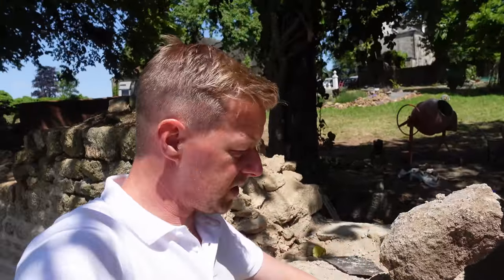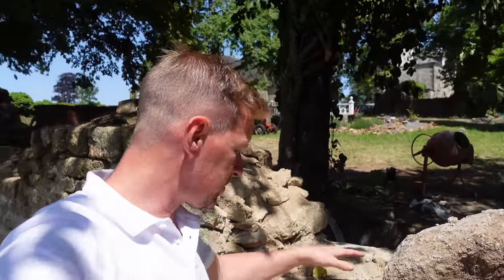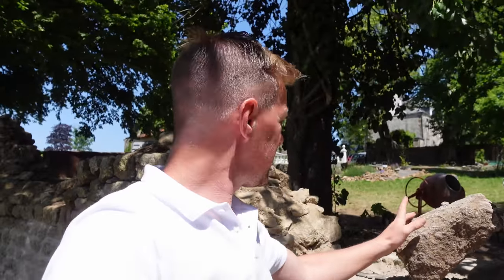So all we're doing as we're going along, once we get the stones in place and the level, we're just backfilling it all. I'm filling that with all of the old stone that's not faced or dressed. We're chucking that in there, putting loads of sand and cement so it just binds it all together. So I'll get this cement mixer on now and get cracking.